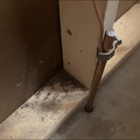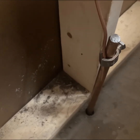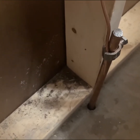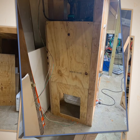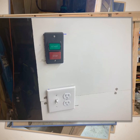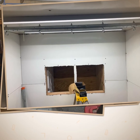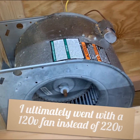That ground wire runs through the wall and comes directly down — it's a 10-foot rod, just sticking up out of the ground, so it's in the ground about nine feet. I left the hole a little big through the concrete. I'm going to put a reservoir and a drip hose down to it and fill that with water.